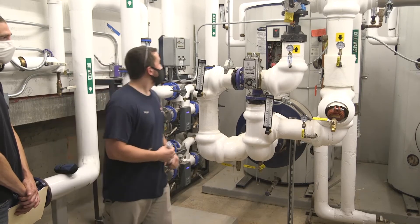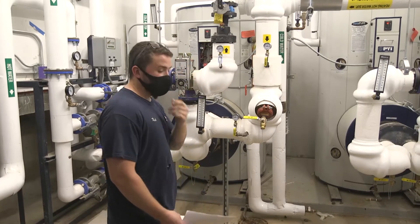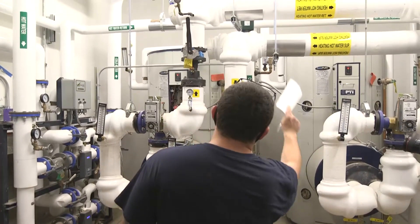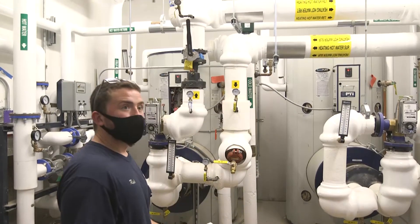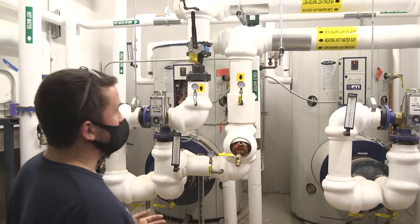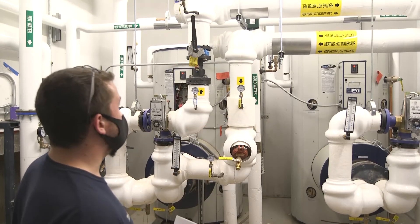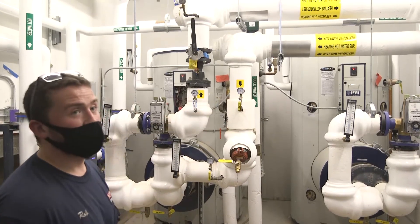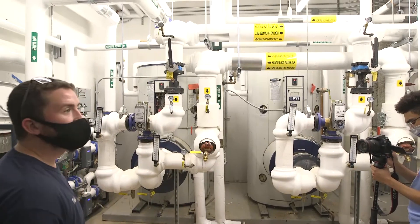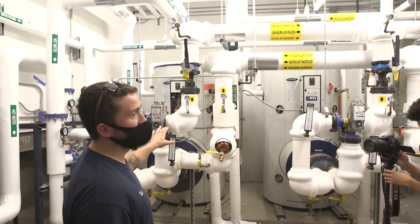That's a blending pump. The control is going to automatically operate it at different times — it's to prevent thermal shock and to maintain an even temperature throughout the tank. When that pump runs, it's pulling water from the hot outlet and depositing it back into the cold inlet. There is not a fault alarm for that pump in particular, but you would get symptoms of it — like very uneven temperatures. If that stops functioning, you may get times where those two numbers are much farther apart than you're used to seeing. That's really part of the control system of the heater — the heater turns that pump on and off automatically.